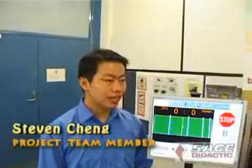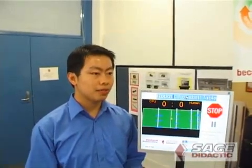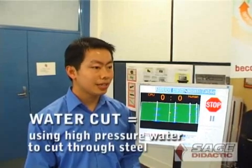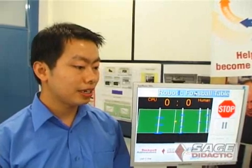The most challenging part on the mechanical side was to line up each row of players, because we have linear motion on one side and rotational on one side. We have to get them into exactly the right positions so they line up and give smooth linear motion. To do that we used a water cut for the plates in the middle, and then CNC drilling of holes for the linear block and the rotational block to achieve accurate positions.